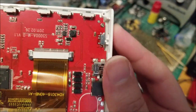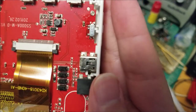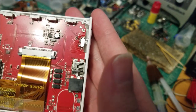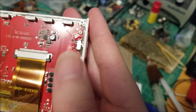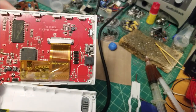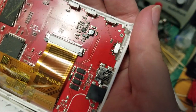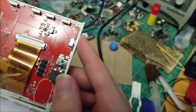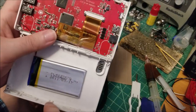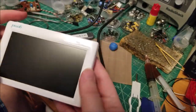Here you can see the switch — when I move the outer switch it moves the nub. So we're pretty much good to go. I'm just going to swab this all down again with a fresh Q-tip and isopropyl alcohol to get all that flux off. Look how beautiful that is — nice and clean and well soldered. This should work. It's on hold right now, so I have the reset switch in — I'm just going to carefully close this back up and snap it together.